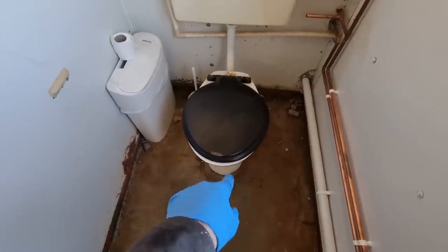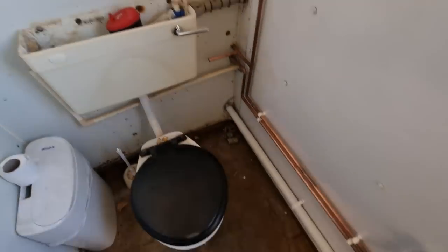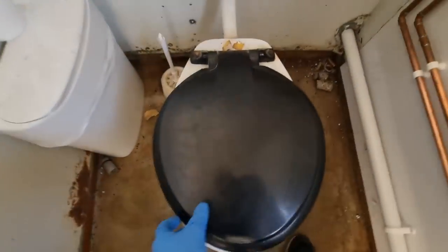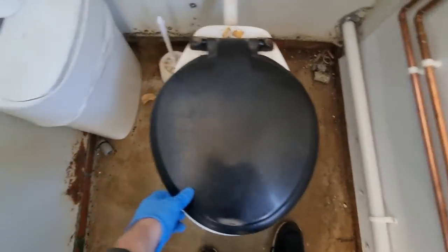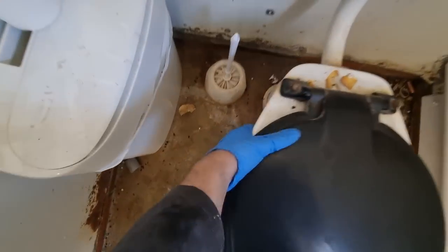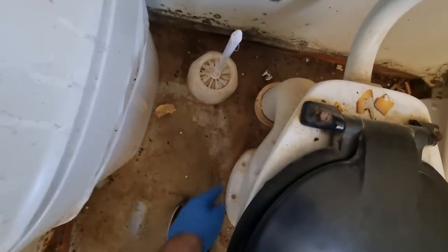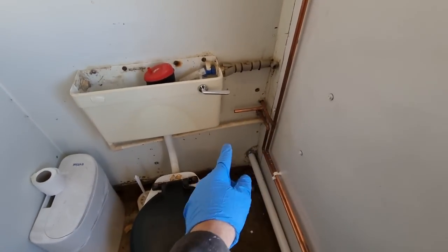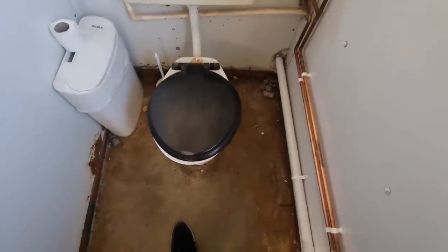So you want all the good jobs today. I've got to change this squat box. I've also got a base to go on there, but I haven't got that yet. So not the worst I've ever seen. It's just a low level pan. This is an S trap one, so I just use a normal pan connector, new system, ceramic, and then just pipe it up. Service valve, bend across, whichever.